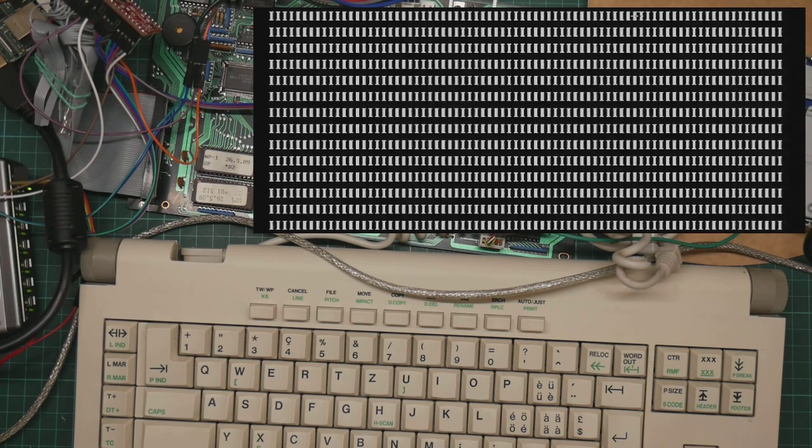Turns out that the wait state stuff was wrong, and I do need some wait state, otherwise nothing happens at all. But it is doing something. It's not very useful, so I think that it's copying the wrong data onto the screen, but it is at least doing something. And the terminal still works. You can see the cursor move. However, there's still some snow, which is annoying. We only have one line of snow, so this is faster.